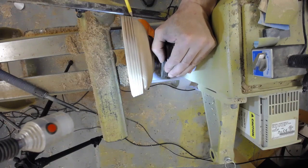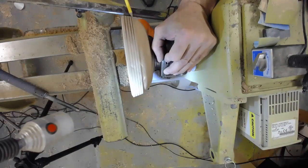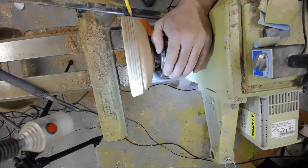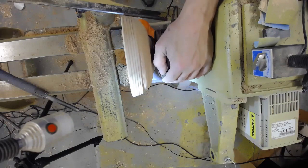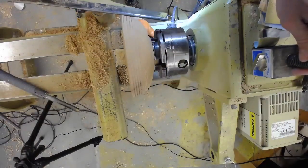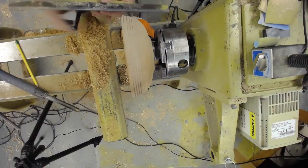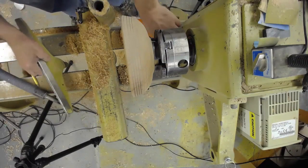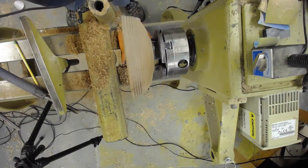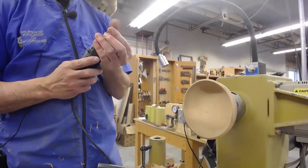You don't need a lot of lines — this is just to keep you, as you're carving, trying to stay in a starburst pattern coming out from center. When I do a rim, I do carve it right on the lathe using a regular Dremel tool on multi-speed. It's got a carbide tip which you can get through Al Sturt — I believe they're made by Creative Technologies or Woodworker Supply. They're not cheap — I think I paid about $70 for the two of them.